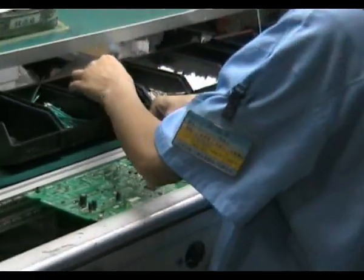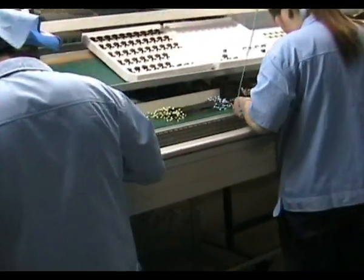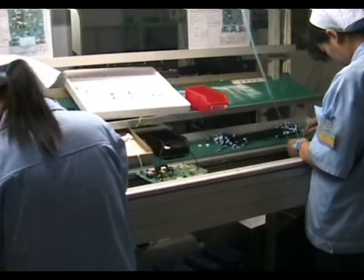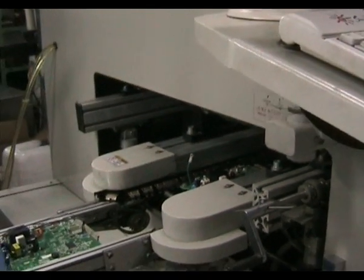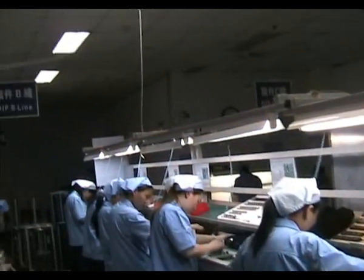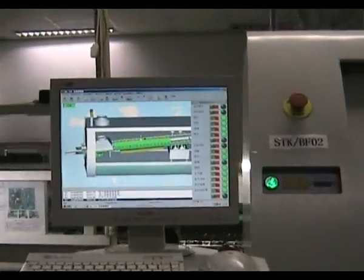They've also got a typical old-fashioned through-hole wave soldering machine, and I'll take you on a short guided tour of that line as well. So here we are on the dip through-hole assembly system. These workers are sitting at a bunch of benches with bins containing the through-hole components, and they're each dedicated to inserting a particular bunch of components. The components can move automatically along a conveyor belt, but in this case they're manually pushed until they get into the machine. You can see boards automatically being fed in, and all workers are ESD set up with their wrist straps.